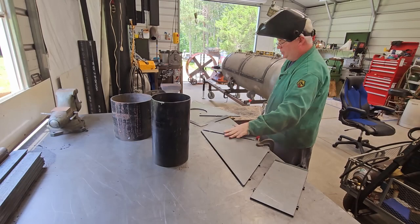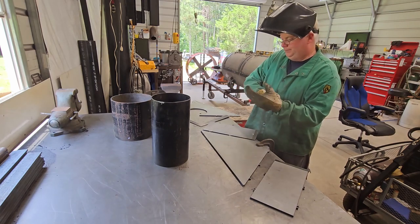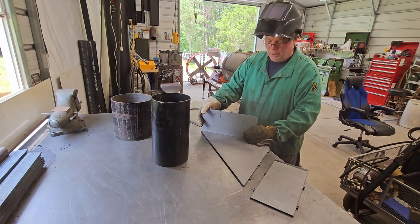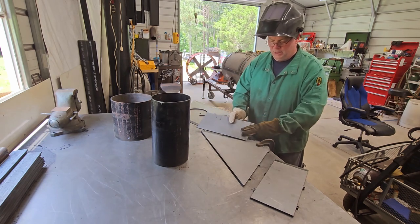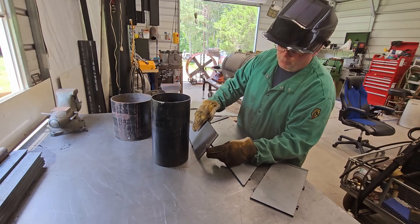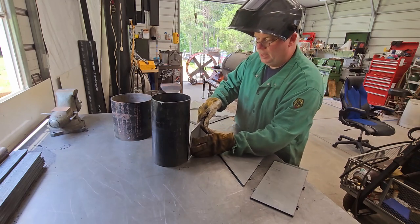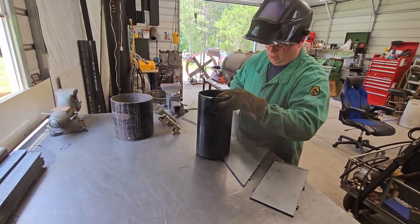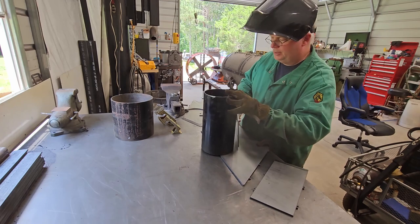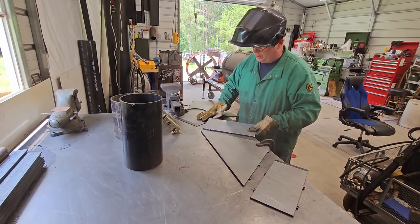This is quarter-inch material — quarter-inch P&O, pickled and oiled. It's incredibly nice material and it is weld-ready when you get it. Notice the bevels I've talked about — the bevel goes down halfway on this quarter-inch material, leaving maybe three thirty-seconds or one-eighth right there. That will fit perfectly up against the stack pipe, making things a little more refined and a lot nicer.